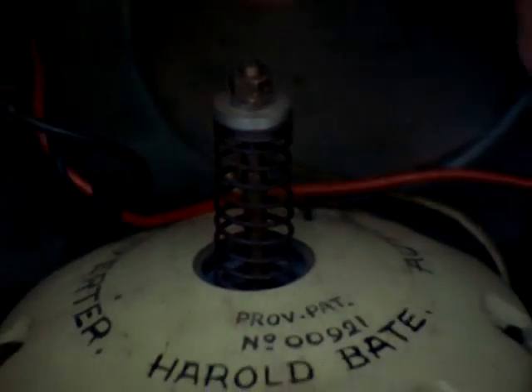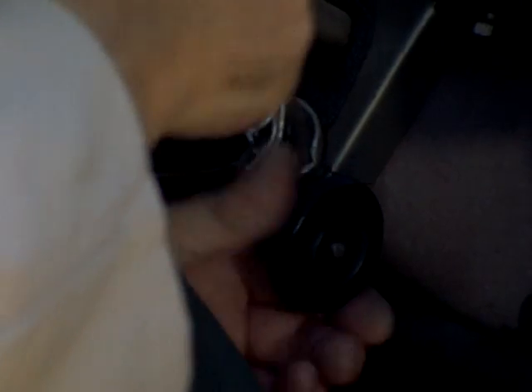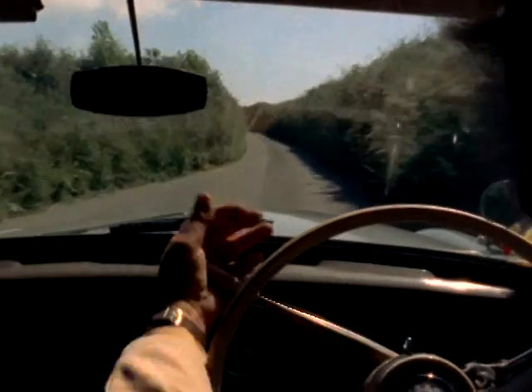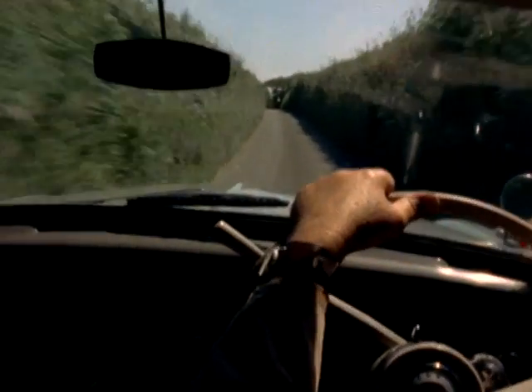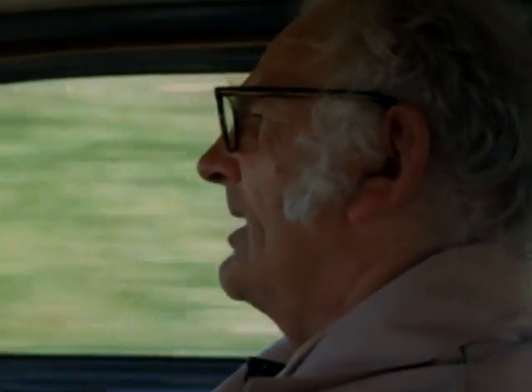It can be taken off one car and fitted onto another. It can be fitted on a 1 horsepower engine or a 50 horsepower engine — the same thing — and it operates the same. Or you can use any other gas with it: propane, butane, hydrogen, what have you. I'm turning over to methane now. The performance on gas is better than petrol — it's faster, about 10 miles an hour past the top speed, and quicker acceleration.